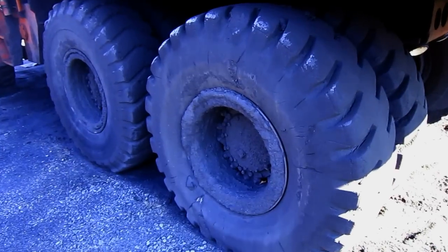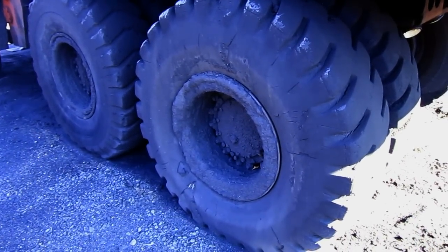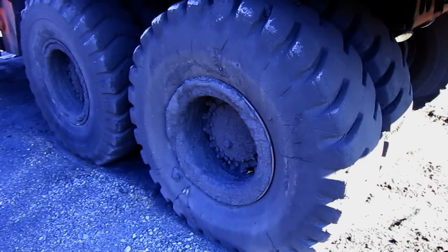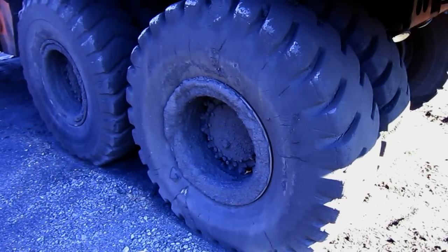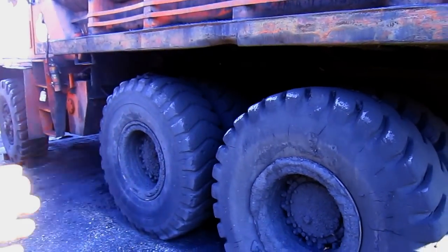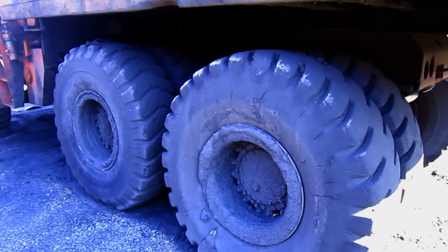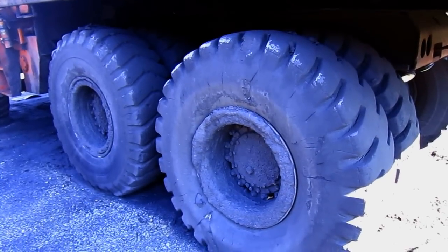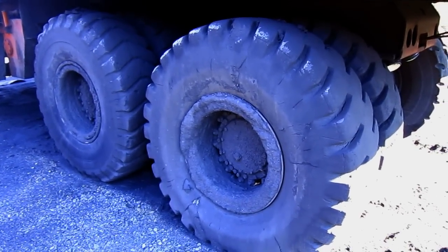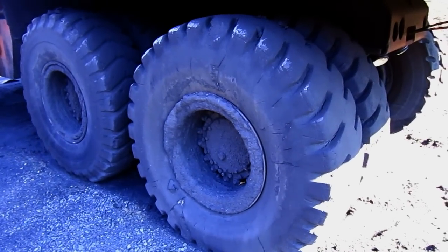The truck features a Mack-designed off-highway bogie, which offers the strength of straight-through and single reduction carriers with Mack Planetary Drive reduction in the wheel hubs. This is a 70-inch wheelbase, and the suspension springs on the bogie, which are called semi-elliptic leaf springs, are secured to the axle by rubber mats which minimize wear and absorb vibration.